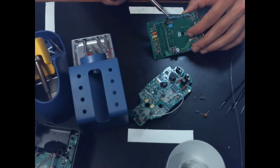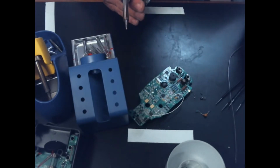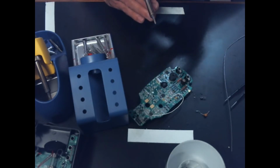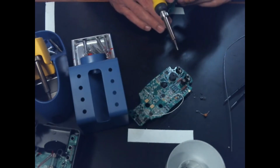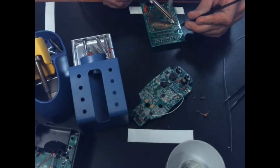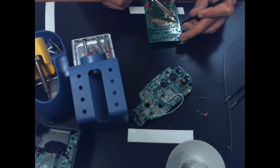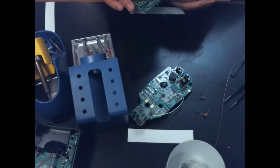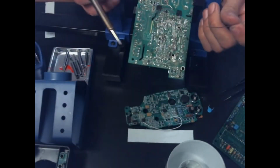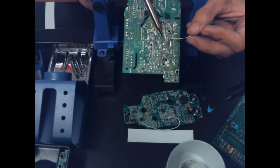We've got a bunch of these resistors here. I think that'll give us a chance to have a pretty fair comparison. I'm not going to use flux on these because their joints aren't as critical as those SMD components to get it to flow. And also, since we're not using hot air, I think we'll be a little bit better off without it. It looks like it puddles it pretty quick. We may actually want to set something up inside of a vise. Y'all can see that a lot better now. Let's try to do a little bit of trace tinning with this.